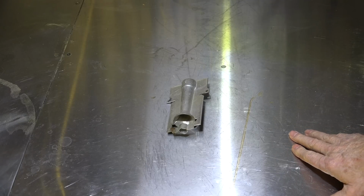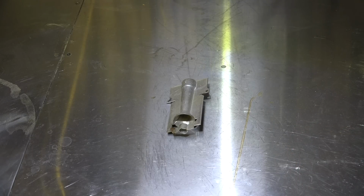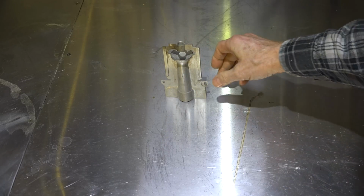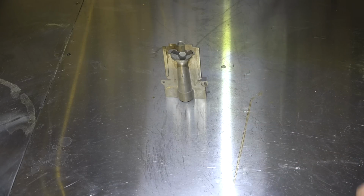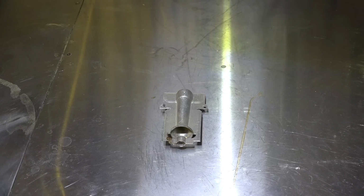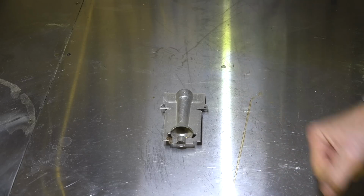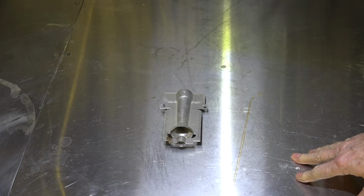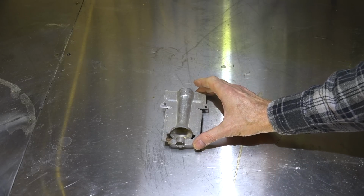Somewhat earlier, I did a video on gas burners, and I showed this burner, which is an inshot burner, as part of it. I wanted to concentrate on this inshot burner for this video. This type of burner will only operate with an induced draft appliance. That means it has to suck in. And I'll show you where it fits in the appliance. But this is pretty much the standard anymore.